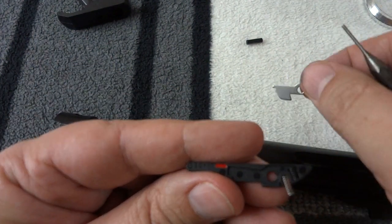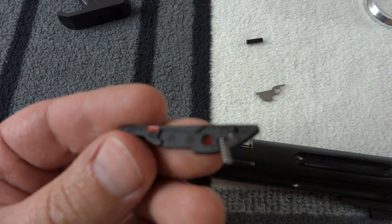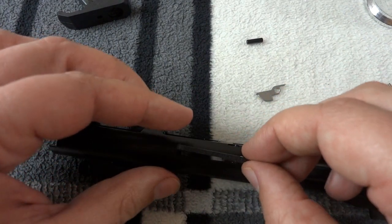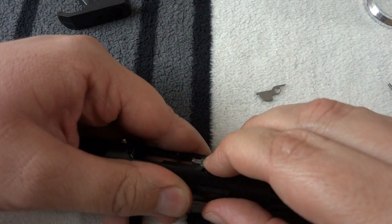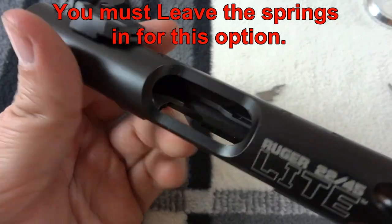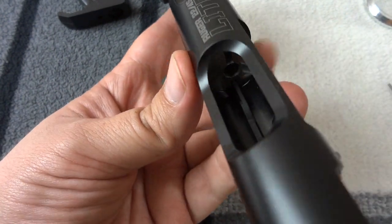I'm going to take that little metal part out. Inserting the loaded chamber indicator — just like that — back into the gun solves the problem and disables the loaded chamber indicator function. Everything is hunky-dory again. It's back in, and it will not function to induce jams. It is no longer in the path of your cartridge as your cartridge is being chambered, and you're good to go.